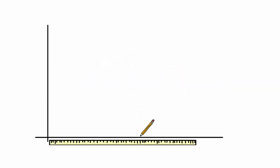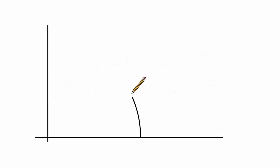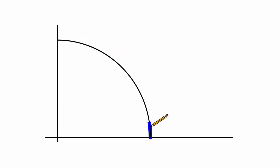Swing an arc between the two lines with the arc center at the intersection point of the lines. Measure 1 inch along the arc for each degree in the desired trimmed elbow. Draw a line from the intersection point to the measured endpoint of the arc.